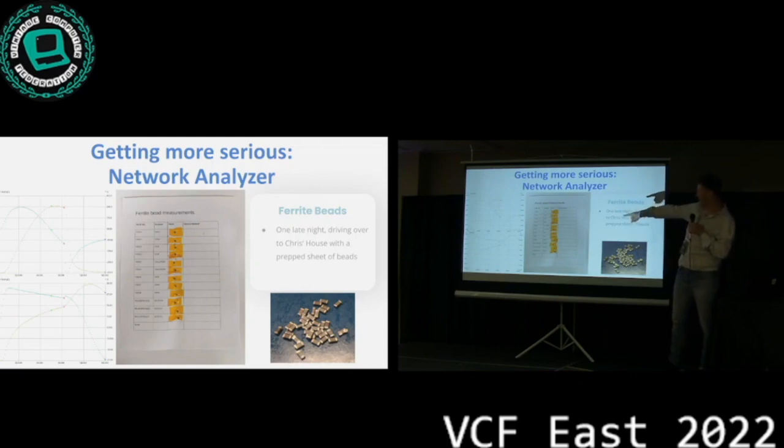And then as you can see, right around 100 megahertz, all these curves make some weird bump, right? And we were like, what is up with this? We must be doing it wrong. Well, it turns out the NanoVNA is a very cheap piece of equipment. They're like $80. And for the most part, it's accurate. But because of the way they're designed, they have this problem at 100 megahertz where stuff becomes inaccurate. But we didn't know. We thought, hey, maybe the parts are broken, maybe whatever.